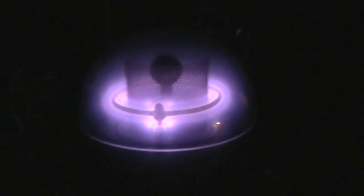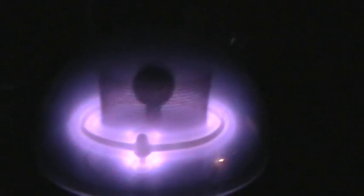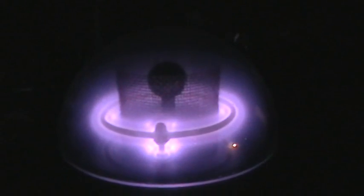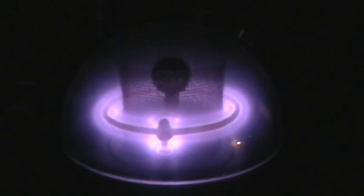Notice that the anode tufting has gone, except for that one right there. So now I'm going to close the valve again to the vacuum pump. The valve is closed and the pump is off. Now you can see that my vacuum system is quite a bit tighter — I don't have that huge rapid leak that I had before, but you can see the process is happening in reverse.